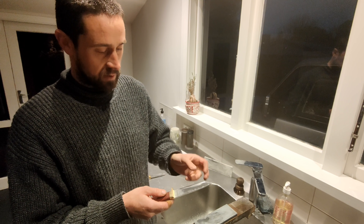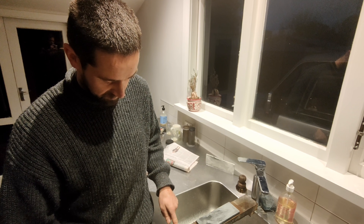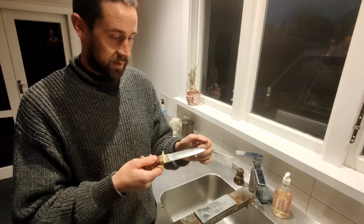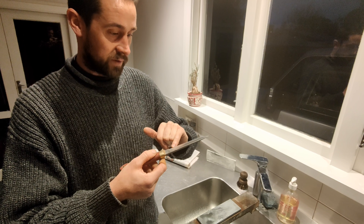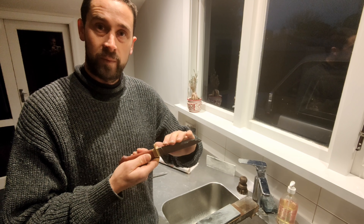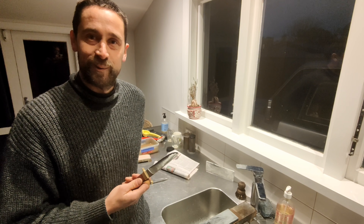The 6000 sort of polishes that burr — it creates a breaking point and then you can draw the blade through the end grain of wood, which can just peel that big burr off. You can see the edge now has got this perfect shiny strip on it. Off the 1000 it was sticky, and you want the edge to feel slippery — when it feels slippery, that usually means you've removed the burr, though under a microscope it still looks pretty rough.